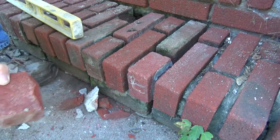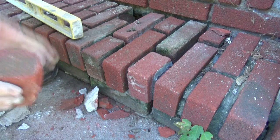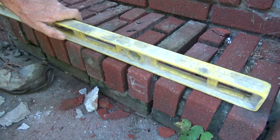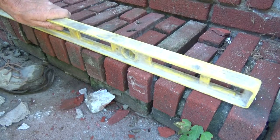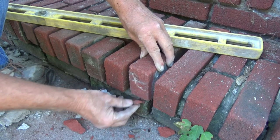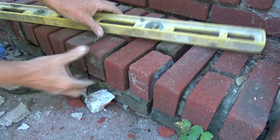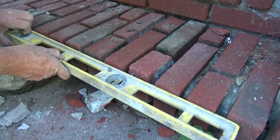You can also do this with a saw if you want. It goes in like that, and then you see some places where it's a little low — you've got to shim it up because that's fast-setting cement, and that's good because the shim stays in there anyway. Like that, and like that. So we're good this way and we're good this way.